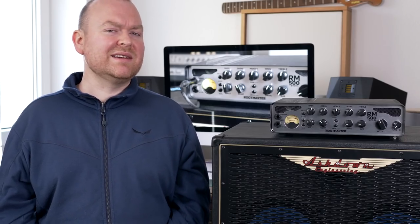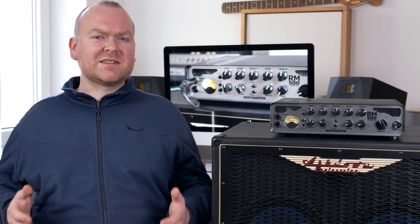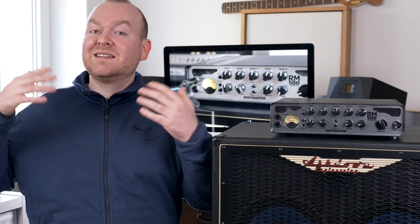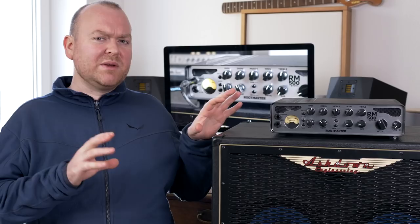One thing I noticed about the RootMaster is how well it actually takes impulses. If you're coming from a solid state or tube amp background, you're very familiar with the concept of headroom — that means there's always room above what you're playing so you can play as loud as you want and the amp stays clean, giving a very natural representation of what you're doing on your bass. A lot of modern class D amps don't really do that, because when impulses get too high, a compressor at the power amp section kicks in to protect the internal components. This amp, however, seems very true to what you're playing and sounds very natural, which I enjoy a lot.